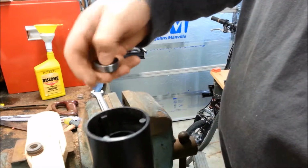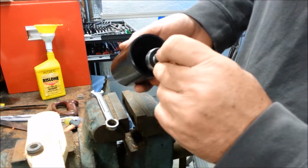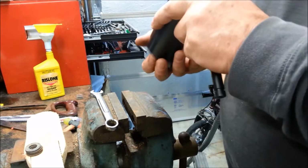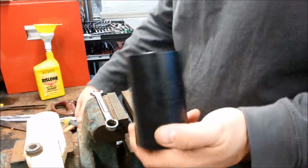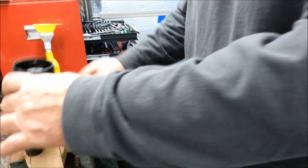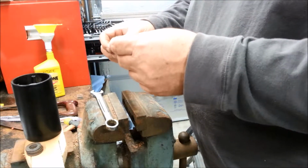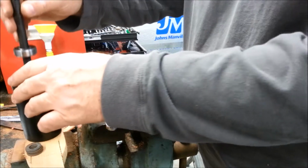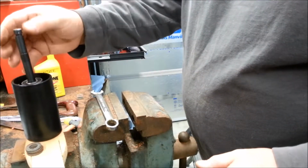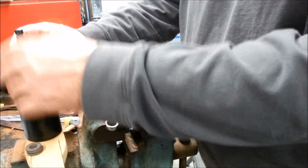I'm going to go ahead and push the bearing into the other side, and then that'll give me a guide to hold that shaft straight so I don't end up driving this end crooked. Just need to think it through as I go. And let's see. I think I'm driving now against the inner race with the circlip. You can use this shaft to hold this vertical. Oh, look.